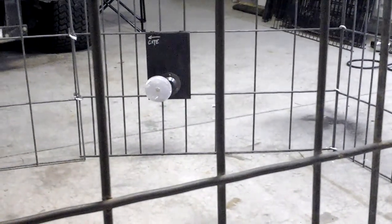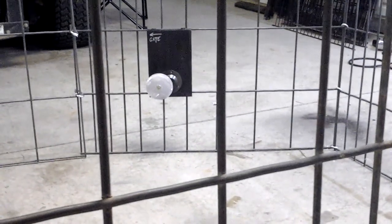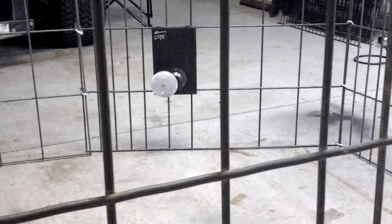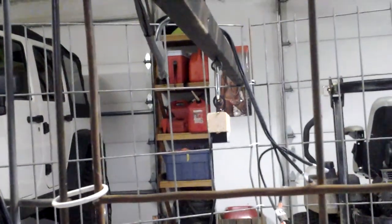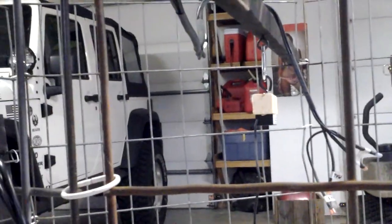On the other side we've got a reflector mounted to a board, also hanging on the side of the trap via two little L-brackets. So the idea is: when the dog breaks the sensor beam, it kills power to the magnet up top, which releases the gate. The gate swings down, closes and latches, and the dog is caught.